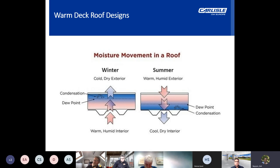The VCL is easier to maintain in a warm construction as it's generally out of the way of plasterboard fixings and downlights. Often the VCL on a warm roof is bonded to a timber substrate, which helps the integrity. However, in a warm roof, the VCL has two important functions. Firstly, much like a cold roof, it stops the transfer of warm, moist air from inside the building into the warm roof layers. And then secondly, while carrying out its first function, it is also keeping the air from inside the warm roof layers inside the warm roof.